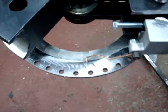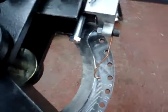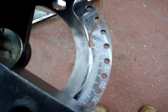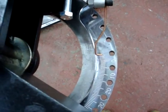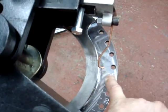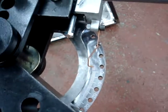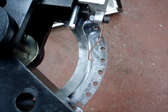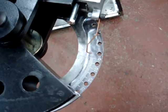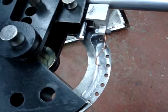The indicator right now is showing — there's a lot of reflection, probably can't see that too well — but right now I'm showing about three degrees before the zero mark. So I'm basically expecting about three degrees of springback. I don't know if that's going to be true, but I have to get started somewhere, so I'll use that as my assumption and then take a final measurement when I get to 90 and see if the springback is correct or not.